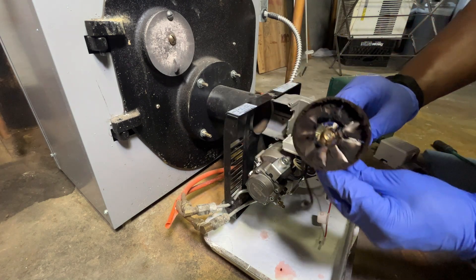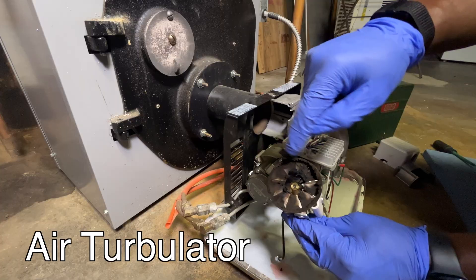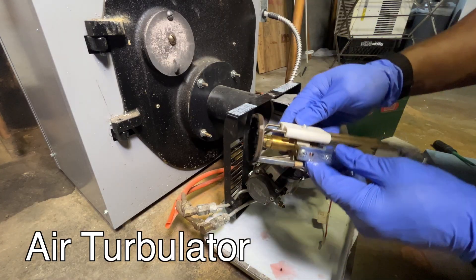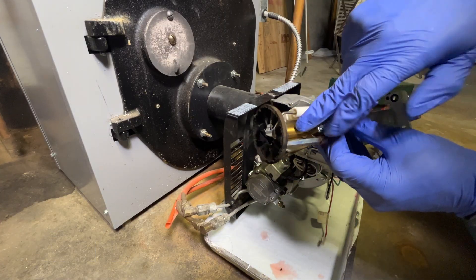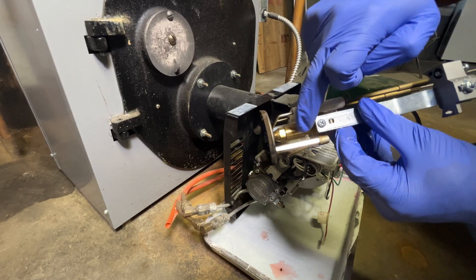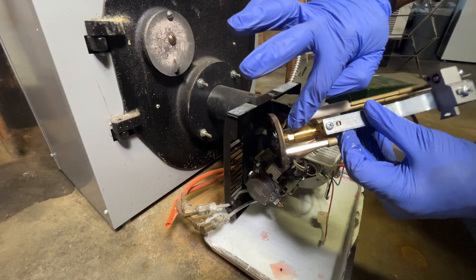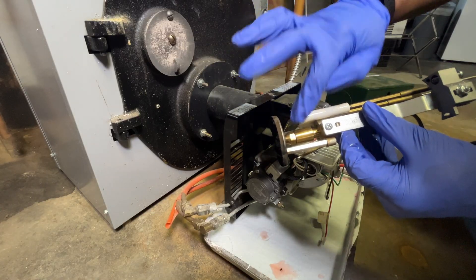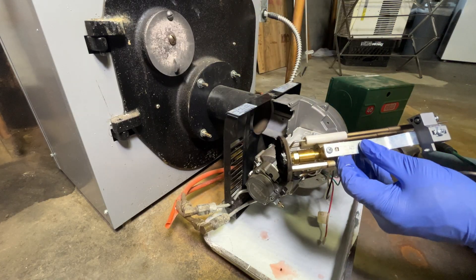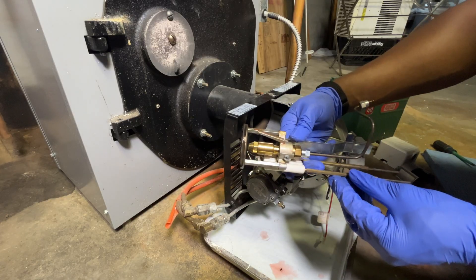When we turn this to the front you'll see the air turbulator, and it is dirty and will need to be cleaned out. From that tiny oil line, the oil reaches through to the front, gets to the nozzle where the filter sits inside, and then squirts out the front. This piece at the very front is your nozzle — that's what we need to remove. We'll turn this over and remove the entire nozzle piece from the housing.